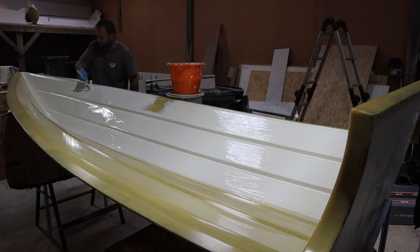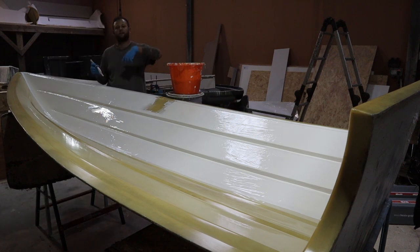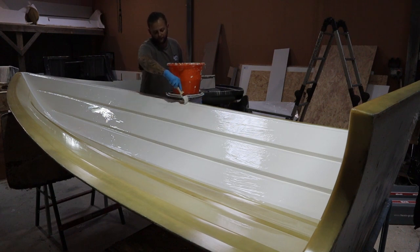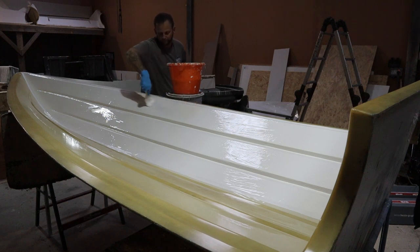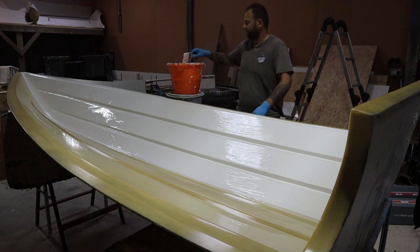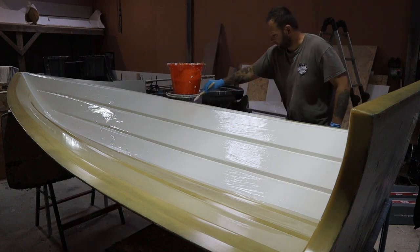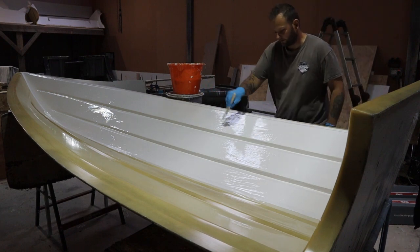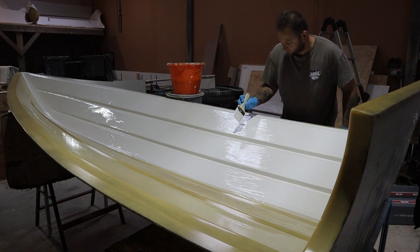Okay, so if you haven't got a compressor, it doesn't matter because you could use other things. Even wafting it with a piece of cardboard will disturb the air and aerate the mould. You could use a Hoover, or like I say, a household fan, or really anything. You just need to move the air from inside the mould and swap out some fresh air. And I'd usually do that a few times before the curing process is completed, because it carries on producing styrene, so you just need to make sure that it's all out and that it's nice and clean for you.